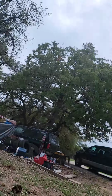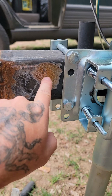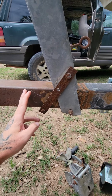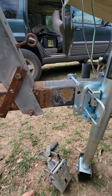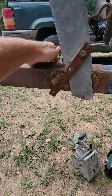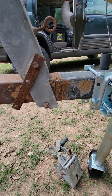When I went to pick it up the first time, the welder had forgot to, right here behind this plate, do the same thing as here. They drilled a hole through, because this is sleeved on the inside a foot on each side of that tubing to make it stronger, because this is only 11 gauge, 3-inch. So I bought a 1/8-inch sleeve to put inside. Well, here he had forgot to drill and plug weld on both sides. So yeah, it took an extra few days to get the boat and the trailer back.